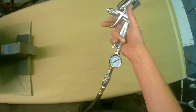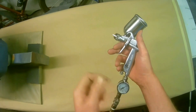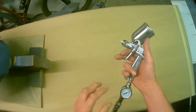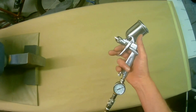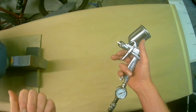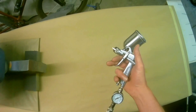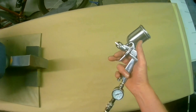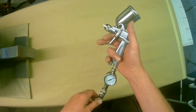I'll put the pots on with a little bit of thinners and we'll just see the fan pattern. The LPH-50 with the E2 cap is designed to run at 0.9 bar, which is about 12.5–13 psi, whereas the E4 cap on the LPH-80 is designed to run at 14 psi, which is one bar. If you use the LPH-80 with the E2 cap it's slightly less pressure — same cap, same as the LPH-50, so 0.9 bar, about 12.5 psi.